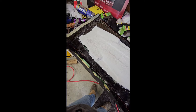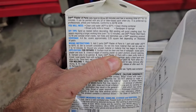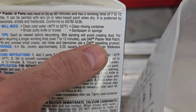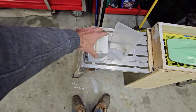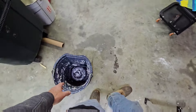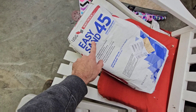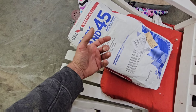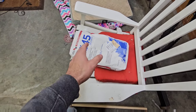So I learned: next time don't use PVA on top of plaster on your original part. They sell small crafting plaster of paris, and if you read the back it says to use DAP wall plaster or DAP spackling products to fill or conceal cracks. I believe if I could find this in a larger container it would be more helpful. I had used the 20-minute version of joint compound and it flashed too fast — it cured too quickly. I needed more time for it to stay a creamy, pudding-like mixture so it would conform to all the spots of these plastic pieces.